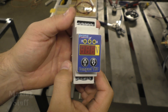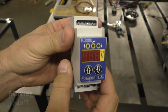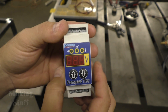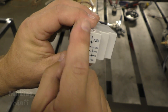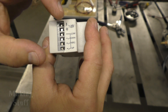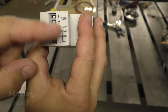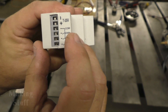This is a Proma Compact 150 torch height controller. I decided to go with this mainly because they have a configuration for LinuxCNC, which is what I'm using to control the plasma cutter. It's a very simple hookup — you supply it between 7 and 35 volts DC, and then these four connections are relay connections that you would connect to the input of your parallel port or breakout board.